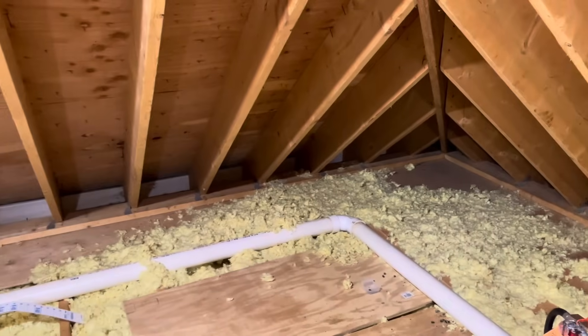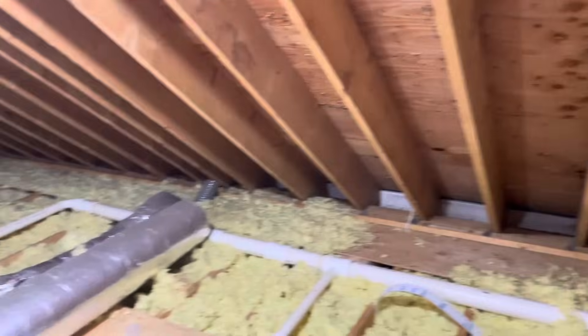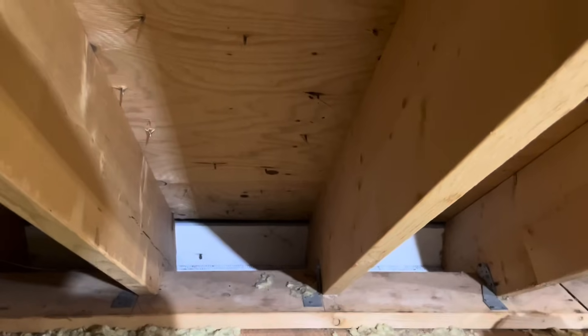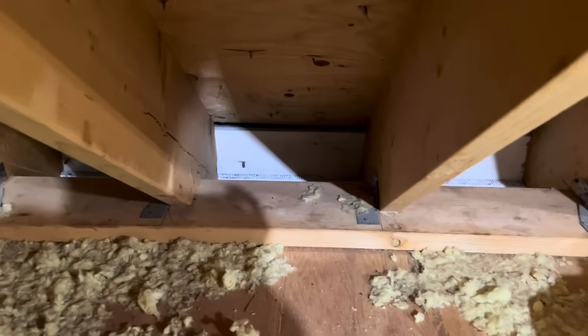I'm up here in the attic and the first thing I want to say is it's hot as heck up here — going up here in summer is not fun. The reason we're in the attic is to analyze how the fascia on the front of the house is built. Even though we're on the other side of the house it's still framed the exact same way, so it's helpful to see what we're dealing with. You can see the big white piece of wood is the fascia, then there's the vented plastic soffit strip, and then the soffit right there. That's where we're mounting our strobe. The plan is to drill up and try to run a wire over the joist to hopefully minimize ceiling damage.